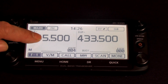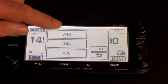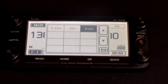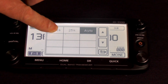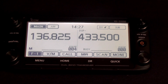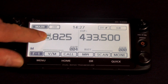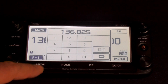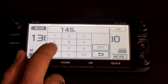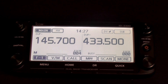You can change band — you've got a choice of two metres, 70 centimetres, or, for the air band enthusiast, an air band button. On the air band, it's possible to select 8.33 kHz steps, which isn't normally standard on amateur radio kit, but it's a useful addition. For frequency entry, you can key in the frequency using a virtual keypad — for example, if you wanted to go to 145.7, you can just enter the frequency. The touch screen, like the 7100, is really intuitive.